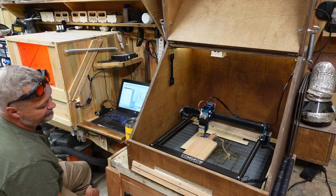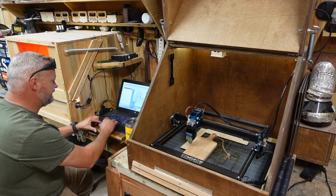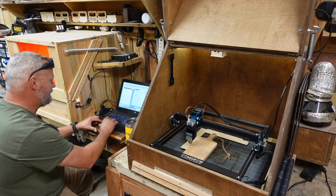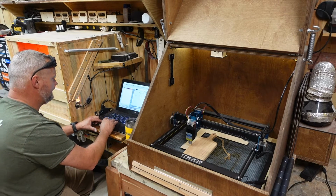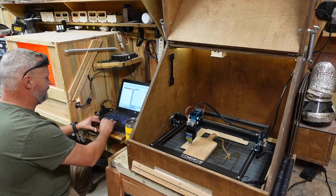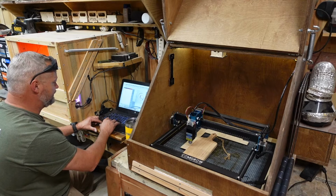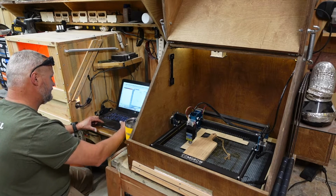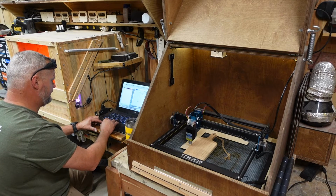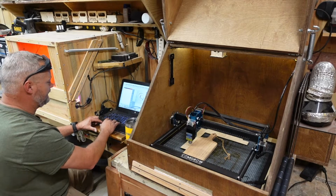because keep in mind, guys, each machine is gonna be a little different. So I'm gonna run this at 40 speed, at 100% output. I'm only running it at 127 DPI. I've got a line in there, it's gonna be running at 100 and 100, which actually needs to be changed to about 70 for this type of material. Everything else is gonna be 40.